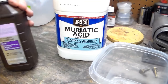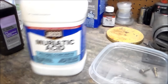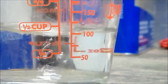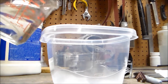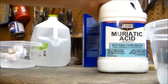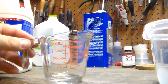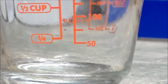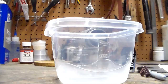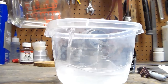Grab your hydrogen peroxide — we're going to mix it two parts hydrogen peroxide to one part muriatic acid. I don't remember much about high school chemistry, but I do remember you always put acid into water, not vice versa. So start off the same way here: get your peroxide in the container first, then add the acid to the hydrogen peroxide. One of the worst things about muriatic acid is the fumes when you open or pour it. I have a box fan constantly pushing fresh air across my workbench so I don't breathe any of the fumes.